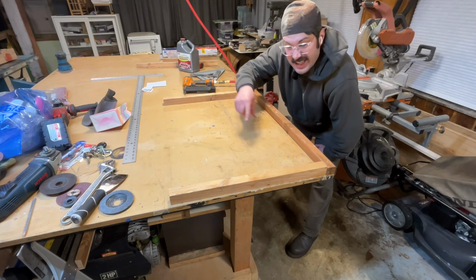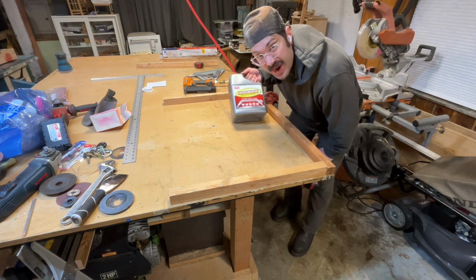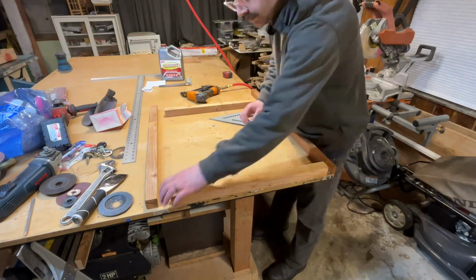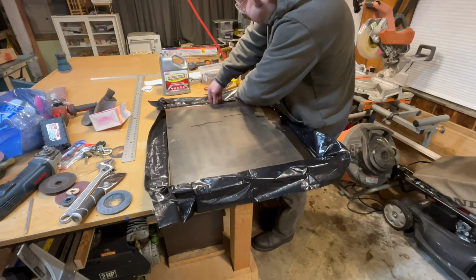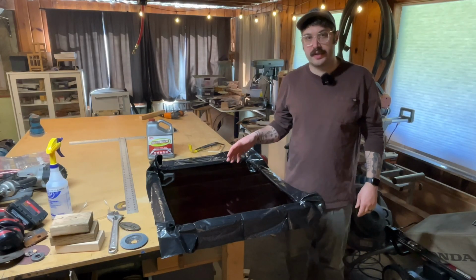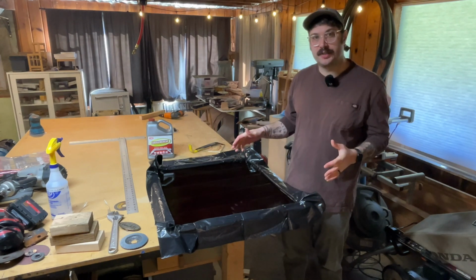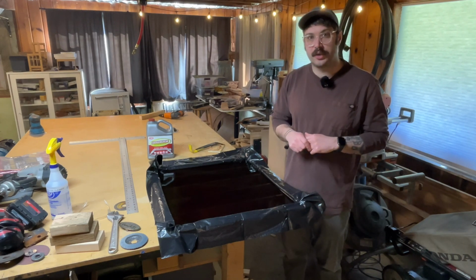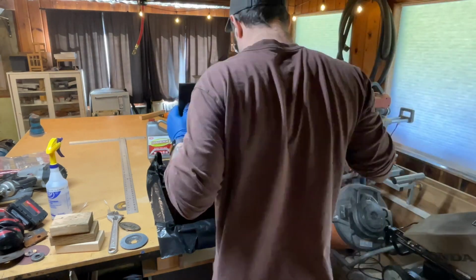Now, I'm gonna nail these pieces of wood to my bench so that I can make a bath of Evaporust to get all the remaining rust off of the plate. I've left my plates to soak in this Evaporust overnight. Now I'm just gonna drain off this solution, and then rinse off the plates. I'm going to cook out all the moisture with like 2 MAP gas torches, and then I'm gonna apply some wax just so that they're sealed. They're not gonna rust anymore.